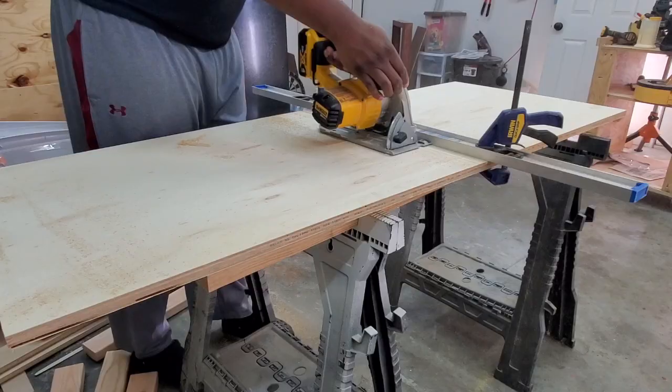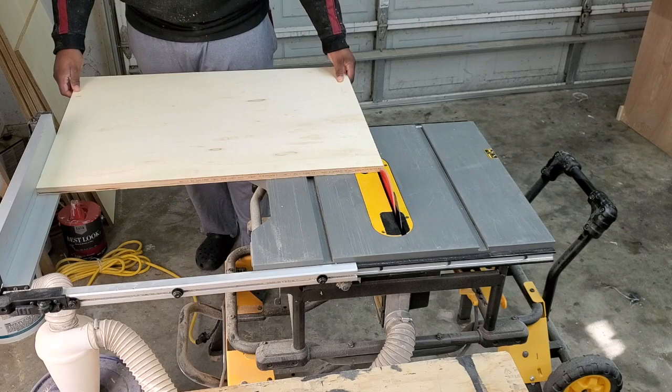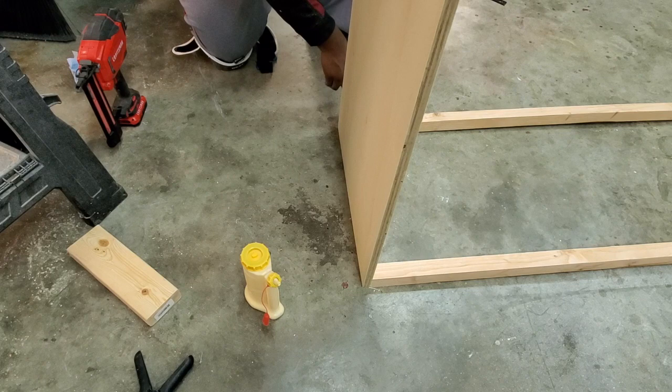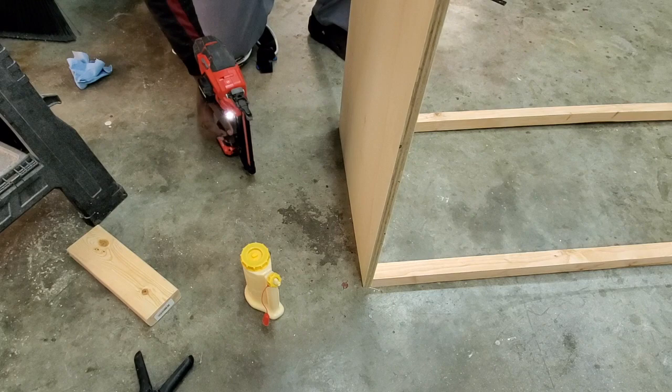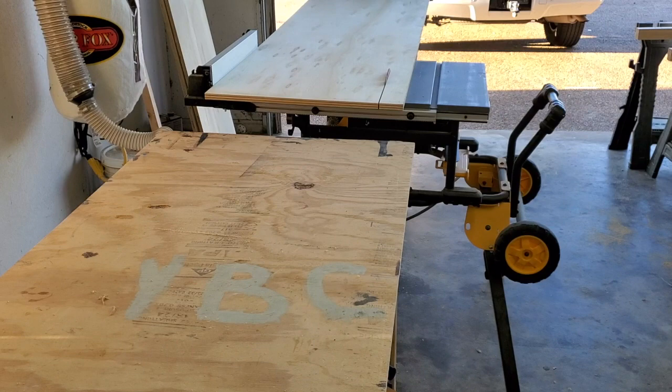To start this project we're going to break down a whole bunch of plywood using our circle saw. Once I have everything cut down to its rough width, I take it to the table saw and cut everything down to their final dimensions. Off camera I cut down some two-by-twos to be the base for my TV stand. To attach the sides to the bottom rails I'm going to use wood glue and brad nails, then reinforce with countersunk screws. I cut the base panel out on the table saw and secured it using brad nails and wood glue.